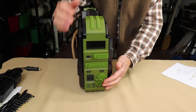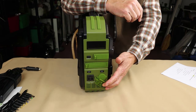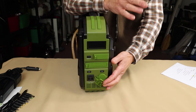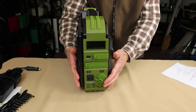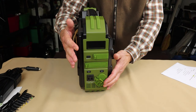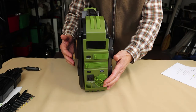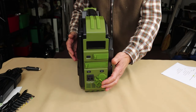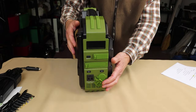In fact, I've been able to run things a little higher than 600 watts — maybe 650 or 670. The literature says actually 700 watts. I didn't intentionally push it that high to find the trip point. But I can safely say you can run items up to 600 watts, which is important. The idea is to match the output wattage to whatever device you want to plug in. You may be able to get a small coffee maker going, but it's unlikely you'll run a large table saw off it.